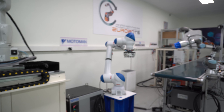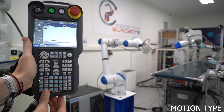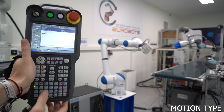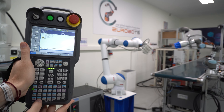Now that we have verified that the movement has been recorded, let's go into motion types. To change the movement from point to point in the program, we will have to select motion type at the bottom. If you change motion type, you can choose move J, move L, and other types of movements like circular or spline, which are move C and move S. A spline is a curvy line defined by different circumstances.